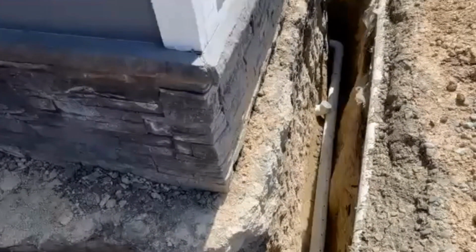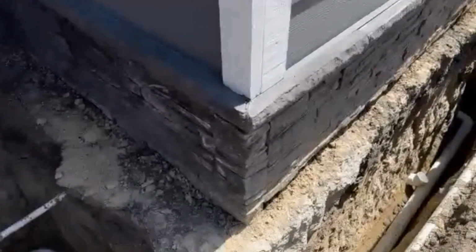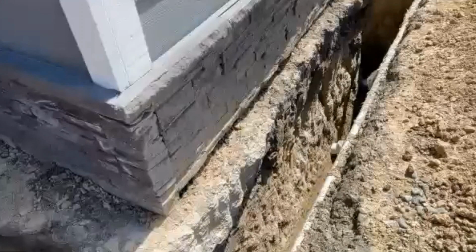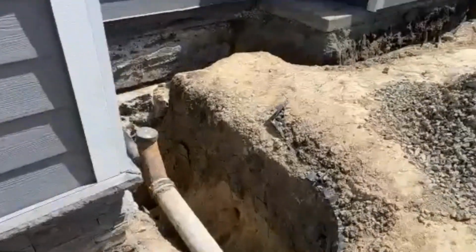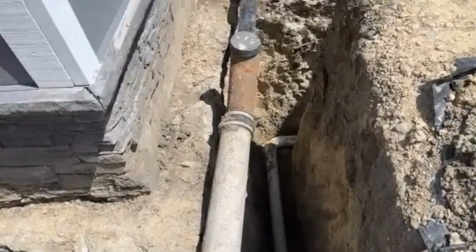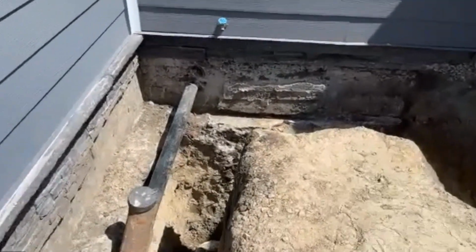Go ahead and put the base of gravel, cover the pipe with more gravel, at least a foot, 2 feet would be better, and then put a layer of geofabric across the top of that gravel to keep the dirt from dropping straight down in. But you're not going to have any real problem with dirt clogging that rock, and even then it's still going to work just fine. But look at all the excavation that she's done here.